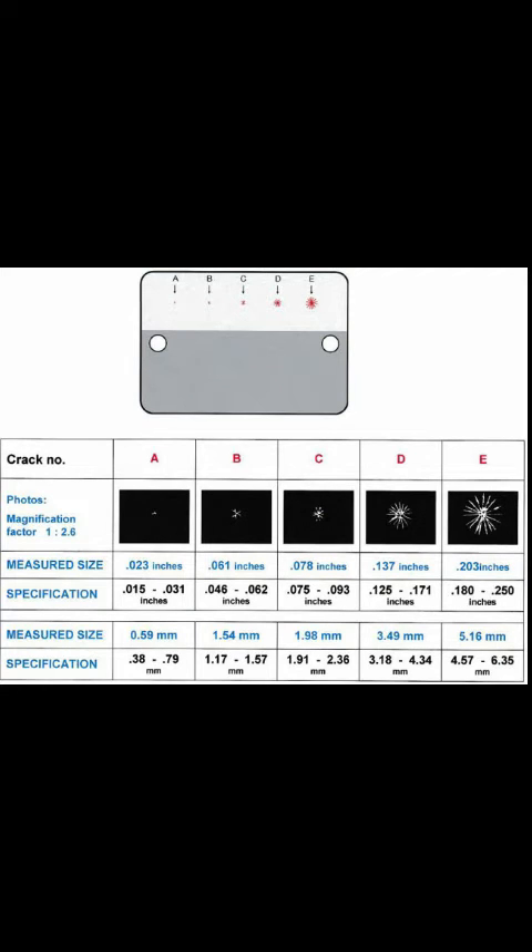The TAM panel has two halves. The first half is plated by a layer of chromium, on which there are five stars with decreasing diameter. The second half creates roughness to check the washing ability of the penetrant and to control the background.